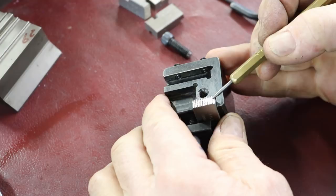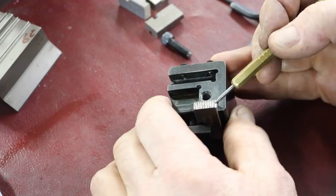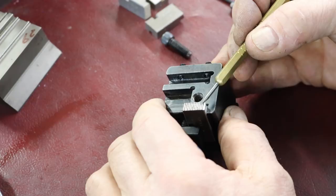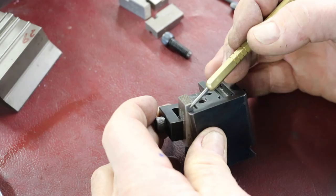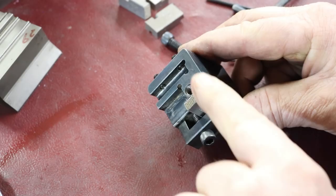This is what's called your chamfer angle. And this could vary. Depending on the material you're going to cut, this will be anywhere from 5 degrees to 45 degrees. Most cases it's in a 30 degree range, but it can be clear up to 45 degrees, depending on the materials. Chamfer right there on the edge. So you'll be tilting this up like so and coming in and grinding right here.